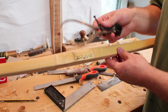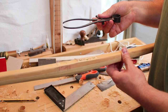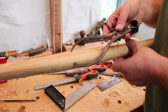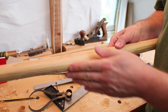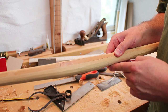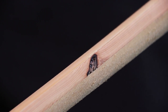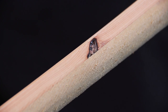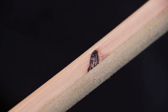Now that I've been working on those limbs, I need to check the depth to width ratio. The handle is still quite thick, because I've been removing a lot of wood from the limbs, so I'm going to need to remove some off the top of the handle to get it back down to an even width-depth. In this particular bow - the triple laminate - there is a knot in there. This would have perhaps made a self bow, but because of that knot, we've sandwiched it in between two other bits of wood to make a triple laminate.